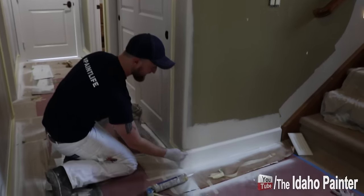So there you have it. We're going to leave you with a few key pointers to perfect this method. One: use the right caulking — clear caulking on anything like stained wood, cabinets, or anything that's not white; use white caulking since it's thicker over any type of white trim or anything else. Any other pointers? FrogTape or 2020 — the type of tape will matter depending on what you're taping onto, and think about the cost involved. Don't use FrogTape all the time if 2020 will do, or you'll run up that materials bill fast. Always pull your tape off before your paint and caulking dries or you're gonna have problems.